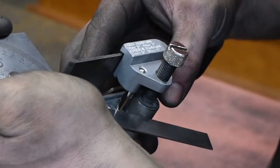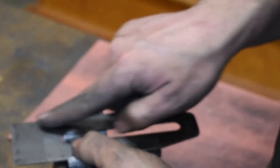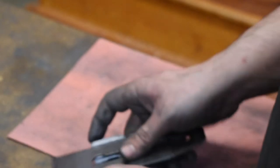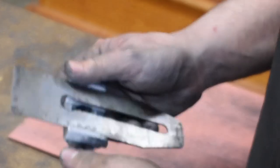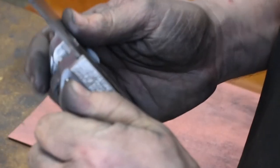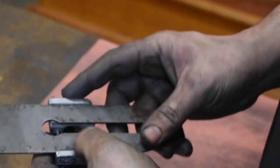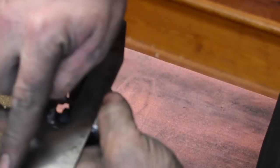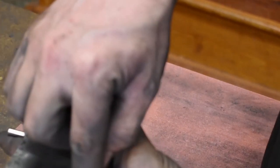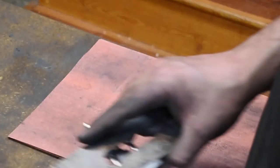I'm at about 27 degrees and I want 25, so I need to slide it up. The nice thing about using a honing guide is you can be sure you're keeping your angle the entire time. Also, because it's squeezing flat against the sides of the iron, you can be sure that the front edge and the bevel are all going to be square and flat along with the sides — perpendicular as it should be. Right on 25.